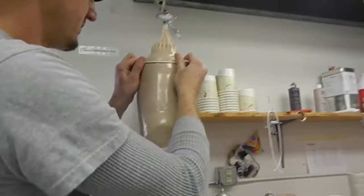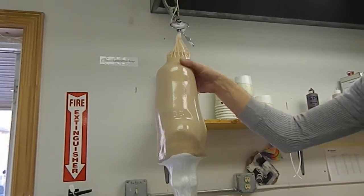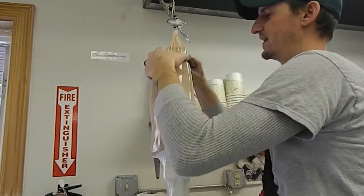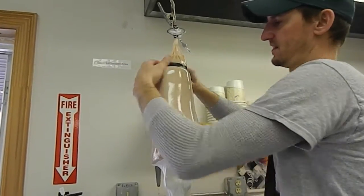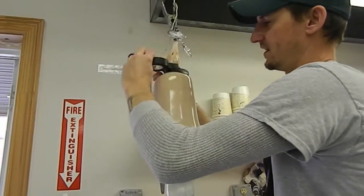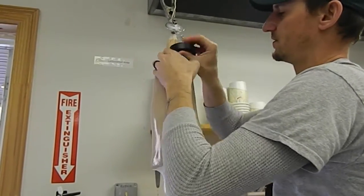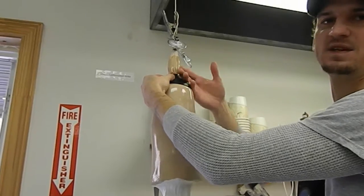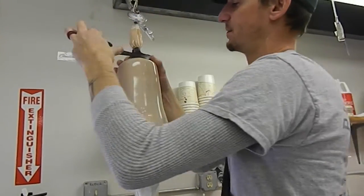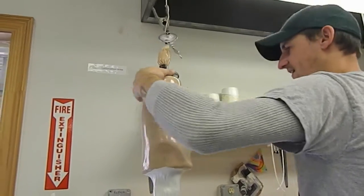I'm going to work real quick — just push up as much resin as possible. From here down it isn't going to be visible, so I don't have to worry about wrinkles in the bag. What I do have to worry about is getting as much resin out of it — for weight and for cosmetics later on, because it will be finished inside from there. I'm taping up where the top of my silver piece was coming out. I'm going to get that pretty tight so I can grind into it, and then tape it off. It's pretty much done.